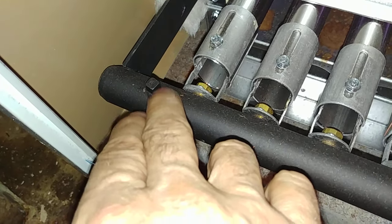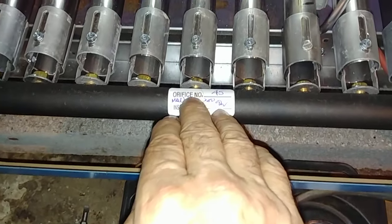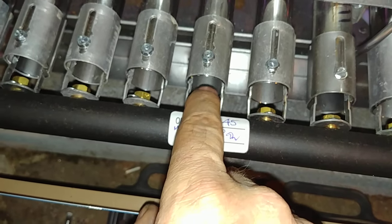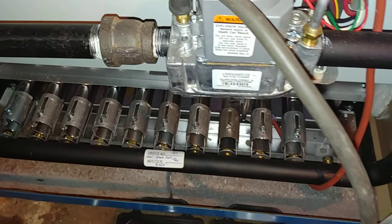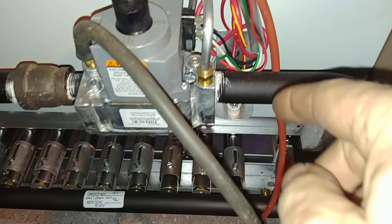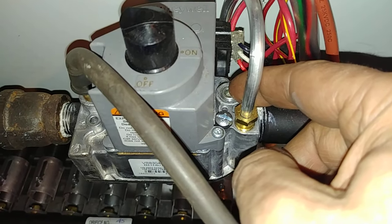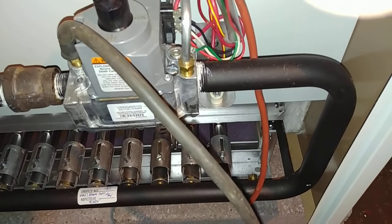You have another tapping here in this manifold, and that's how this is supposed to be engineered. These are engineered with specific orifice sizes — 45 is probably the drill size number of the hole where the gas is shooting into this basically Bunsen burner. So there is a one-inch water column pressure drop through the gas valve.